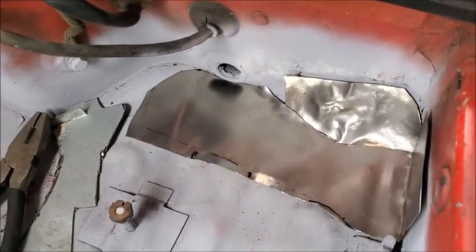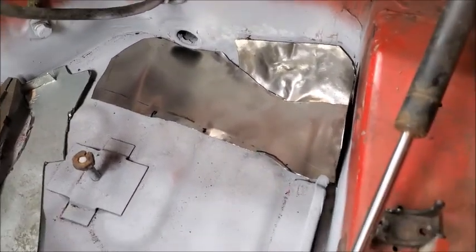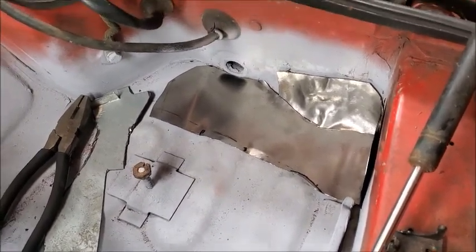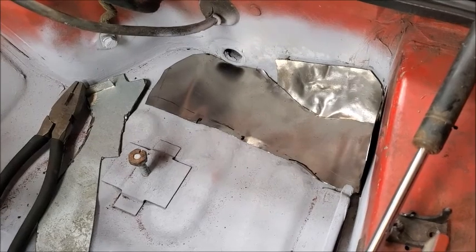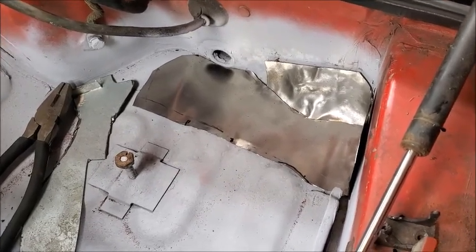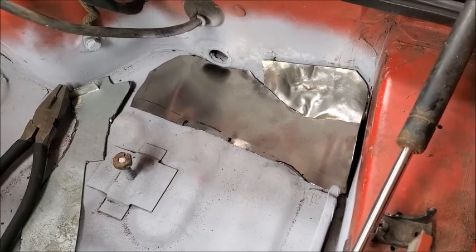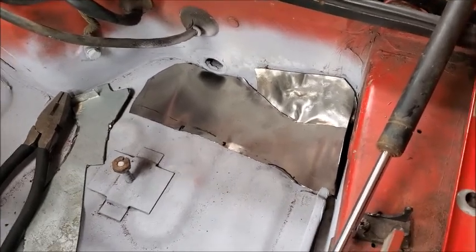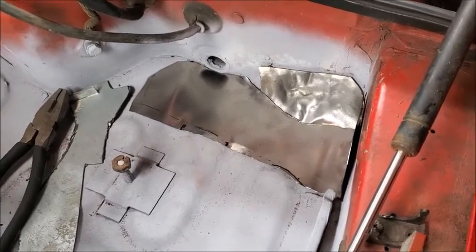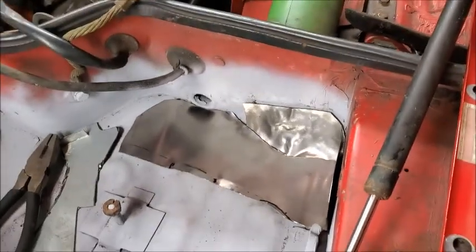I think that's going to work for the metal — all the holes will be filled in with the paste, so I'm not worried about that. I'll drill the holes, flex tape around the bottom, put the rivets in, seal up the bottom, and then seal the top.